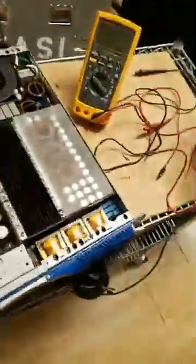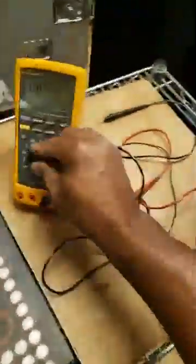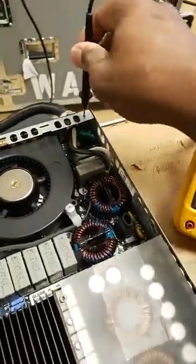So you can see I got the plug in my hand — the amplifier is unplugged. No power going to the amp, it's just sitting here unplugged. Like I said, I was doing some work in it so I wanted to make this video real quick. I got a meter here, we got it set up to DC voltage. I'm going to drop a ground probe right here, which is the ground, and once again this thing has been unplugged — not plugged up at all. I'm talking about lethal reserves of energy in these amplifiers and you got to be real careful.